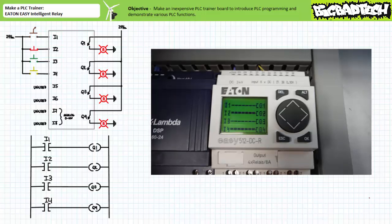Finally, when only the normally open yellow push-button connected to input four is actuated, the operational program shows that inputs two and four are allowing logical continuity onto outputs Q2 and Q4 with a highlighted bold rung.